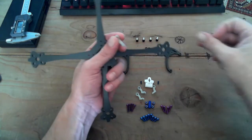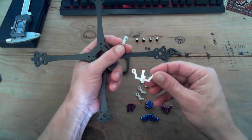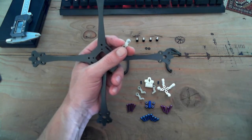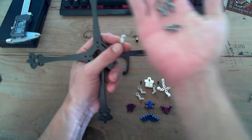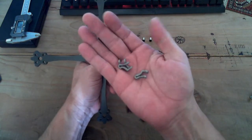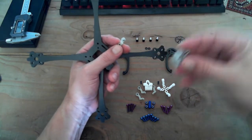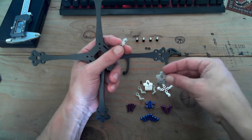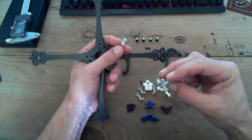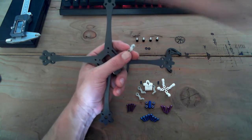I'm going to go into a little bit more detail about these pieces. I've been prototyping a lot of different material types. You can see here I have a different type. I've got the aluminum, and these are threaded for M3. I've also got aluminum versions of the brace mount bracket. Those are 3D printed. They do need to be tapped. I can and do tap them, and that actually works really nice. Just a little bit heavier than the plastic.